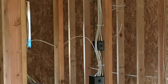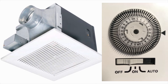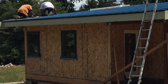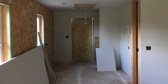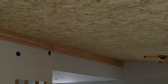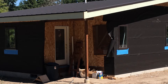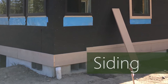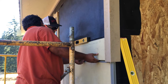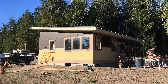Next, the electrician runs wires through the walls and ceiling to all the outlets. He uses the electrical chases to run wires through the SIPs. The bathroom exhaust fan has a timer so it can be used for both bathroom exhaust and air exchange. The house will be so airtight that a simple air exchange system needs to be employed to keep the air fresh inside. Sheetrock is added to all interior surfaces except the ceiling in the living room area, where I'm going to go with the exposed surface of the SIPs. While the drywall guy is working inside, the exterior walls are wrapped with black felt, which acts as a water-resistant barrier. Next, exterior siding is installed over the felt. Hardy fiber cement boards are used — they look great and last a lot longer than wood and most other materials. Panels will be used around the bottom of the house and hardy planks will be lapped around the top.